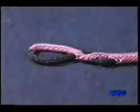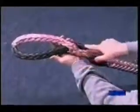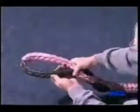The lock stitch buried eye splice is one of the most popular splices for twelve strand rope. In this splice, the tail of the rope passes through the body once, then through the body again, then is buried down into the standing part of the rope. This splice also works on the Chinese finger locking principle and is very effective, especially when used with a thimble. However, it can be pulled apart if you pull on the tail end of the rope.